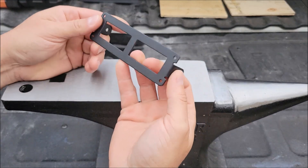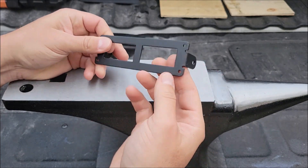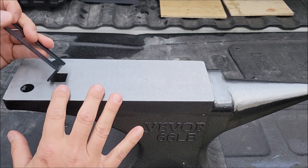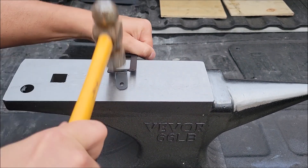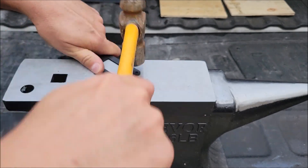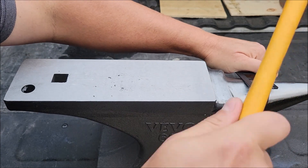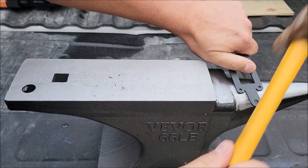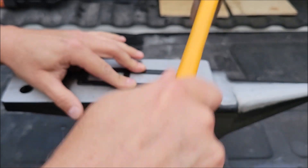This is a somewhat crude example, but say I had something like this — a switch holder — and I wanted to mount it flat instead of inside another bracket. I could use the hole to get me somewhat straight, and then come in here and work this metal bracket nice and flat. If it didn't want to work flat, I could come over to the angled side and really work it to get it to bow exactly the way I wanted it, before coming back and working it flat again.